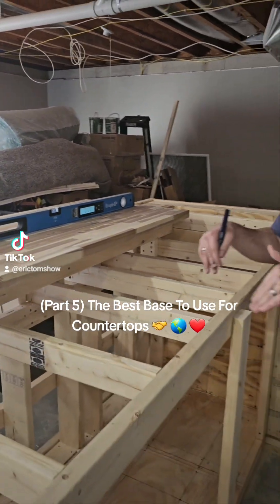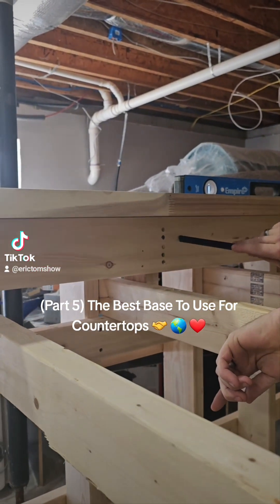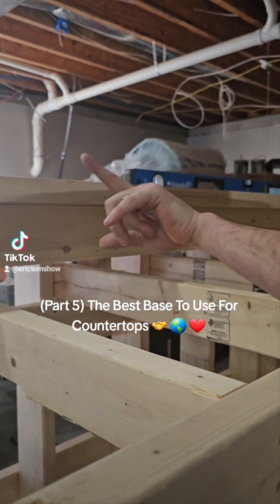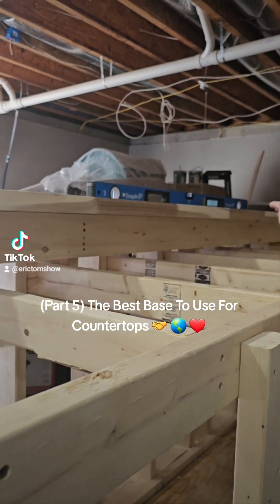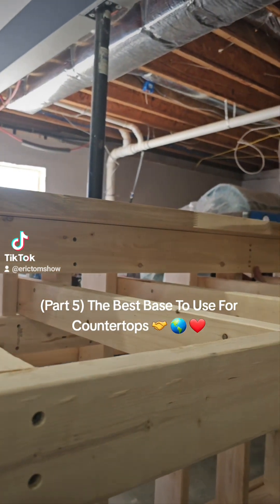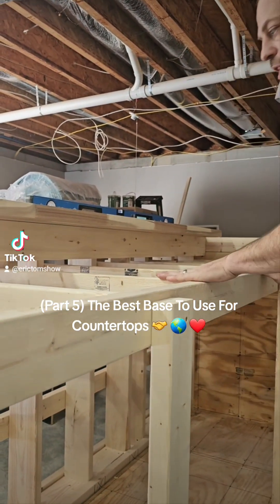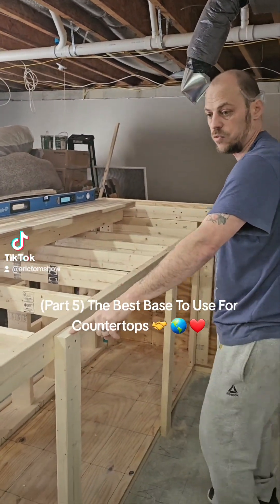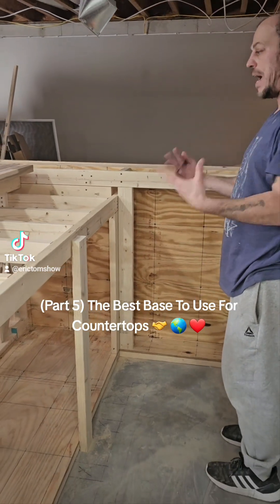That's what you're looking for. Peek underneath — this was all timed out really well. We ripped this two-by-six to be short because it was going to hit the beams going across and lift our counter out of level. We went ahead and ripped that off, made it like a two-by-five. Once the counter was in and everything was level, we pushed it up all the way across, clamped it in place, and started screwing it so that when we brought it back in it would sit tight and flush. The other counter is going to come back and touch right here with the overhang we needed.